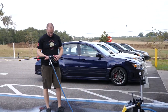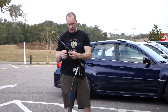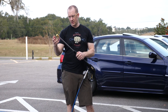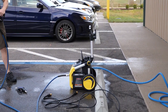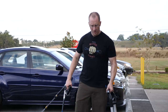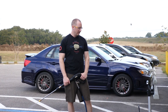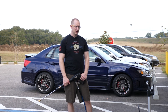The 1900 PSI model has a different gun with a stainless end on it, so you can quick-disconnect it. The foam cannon fits on the end here too. It comes with a 40-degree nozzle as well as a 15 — just to stay consistent, we'll leave the 15 on. This is 1900 PSI rated at 1.3 GPM, and it's quite a bit heavier — 18 pounds heavier than the last one. It weighs 39.3 pounds versus the 1800's 22.4. And it's $229.